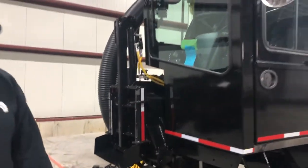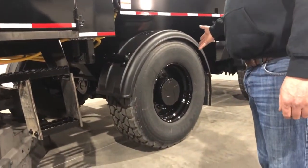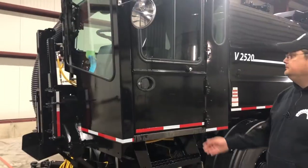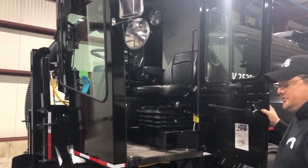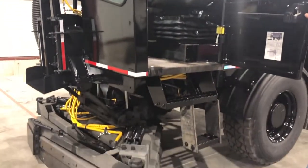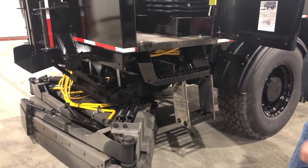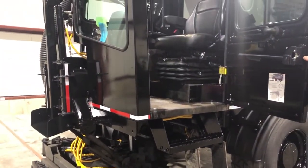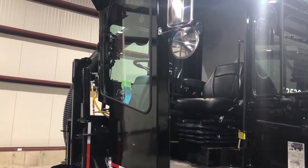As we come around here, look at your last wheel and tire — make sure that the pressure is good and the lug nuts are tight. Before we enter the cab we want to double check the condition of the steps, making sure they're in good shape and can support the weight of the operator. Before we enter, we look for any tools or garbage left behind by previous operators that could cause a distraction during operation.